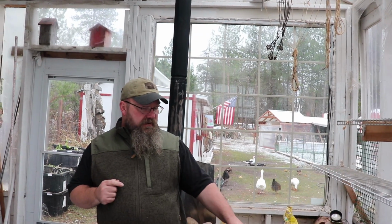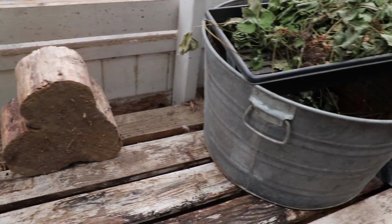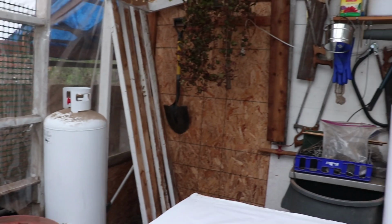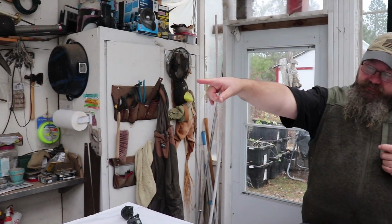So we're going to take all of these shelves off. We'll probably repaint all of them. It's about time for them to be dried out and painted again. And run around with some squirting foam and caulking, get the tidbits that are bleeding some cold in, and try to get that sealed up as best we can. And again, that's the idea. So when this cupboard goes over here, and I forgot that part,